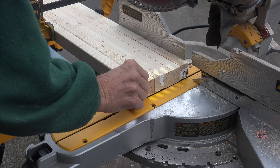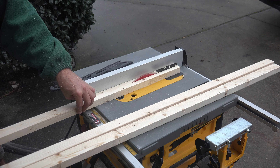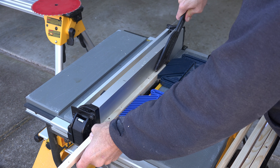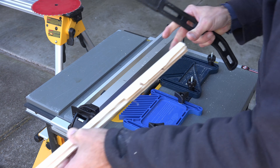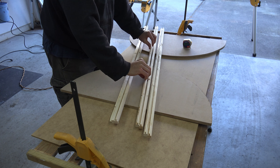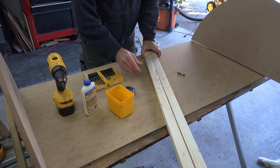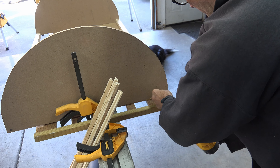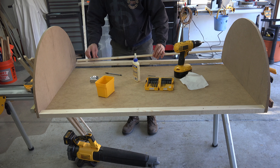To make sure all my pieces were perfectly flush with one another, I clamped them together and cut each end at its smallest board. I still thought they were a little too wide, so I took each board back to the table saw and ripped them in half one more time. With each piece now an inch wide and a half inch thick, I placed a rabbet in each piece. What I'm hoping for is that the plexiglass will sit in each rabbet and with the slight angle of each piece to make the arch curve, that will be enough to bend the plexiglass and hold it in place. After looking at all the pane strips, I thought I would need a little more strength from the back two pieces, so I cut two more for the right and left sides without rabbets, then screwed them into place. I then took two pieces with rabbets and placed them over the thicker pieces so I would have my plexiglass grooves.